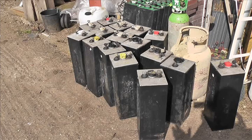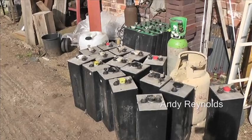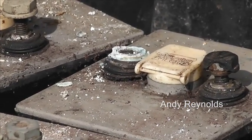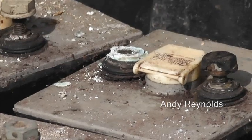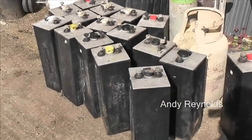I left it until now to see whether there were any cells that would self-discharge, and there weren't — none of them went through the floor. So I've actually taken the pack out, thinking this is taking all the charge and it's not doing the other two packs any good. We'll give it a really good inspect. I left them disconnected for about four months, and what happened was — let's zoom in — a lot of the positives started corroding like mad. Virtually every positive in this collection of batteries started to corrode. That's a clue, because there is such a thing as positive pole corrosion.